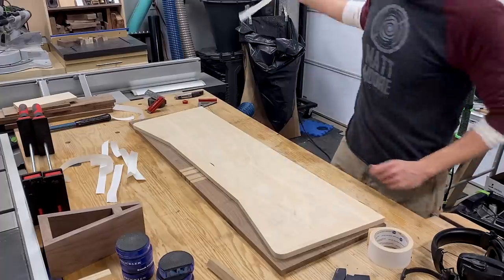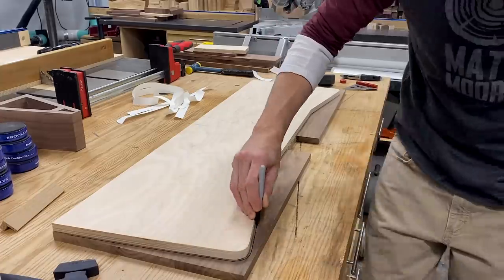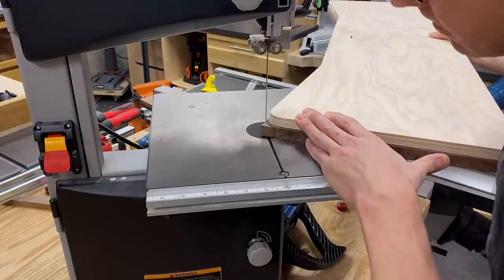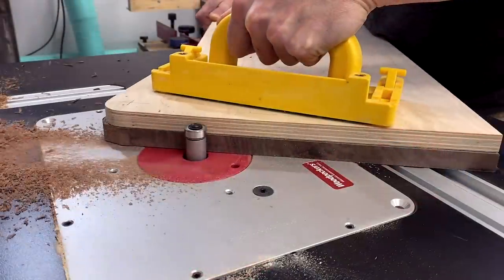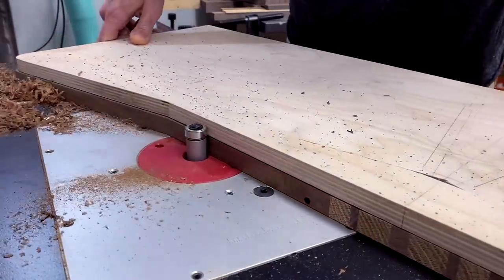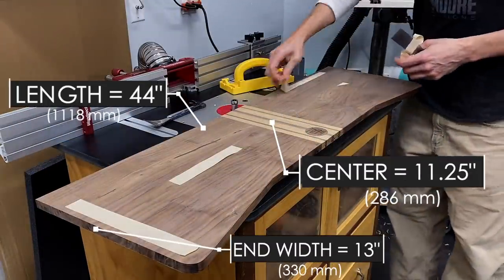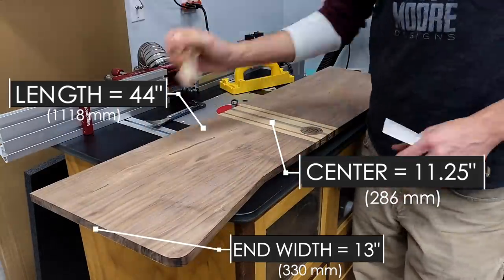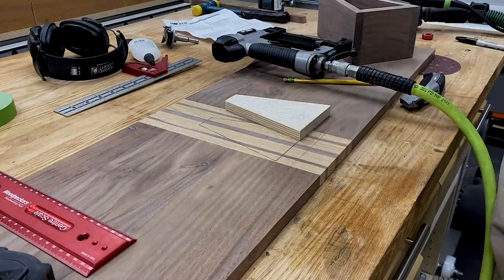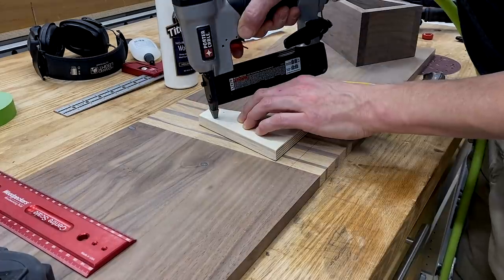But before I do that, let's template route our monitor stand using double-sided tape. Stuck that down, and then I'm just using a magic marker to give me kind of an eighth of an inch outside of my template to cut to. And then I'm going to use a flush trim bit, which gives me a nice smooth edge matching my template perfectly. And I can remove the double stick tape to reveal what lies beneath. If you're wondering, the top is about 44 inches long and 13 inches wide at the ends. I cut this triangular piece of plywood to basically be the locator for the center section, and it will also house the wireless charger for my phone.